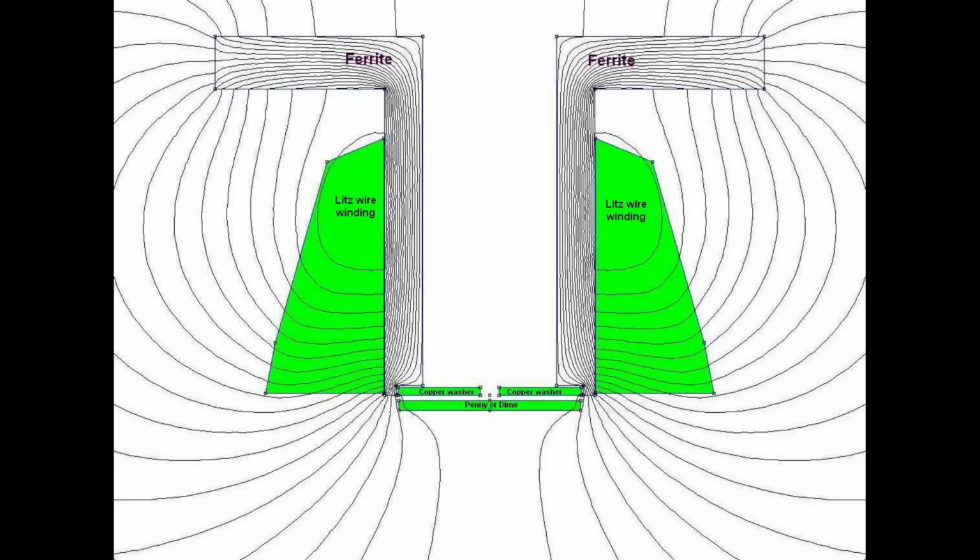It's essentially being pushed from underneath, even though there's no structure underneath, because the field lines that are coming out just outside the diameter of the coin expand outward mostly, but some of it expands inward and lifts up the dime or penny. And because a lot more of it goes outward, that's why this is relatively inefficient, but it can actually pick up objects like dimes.